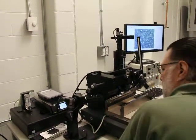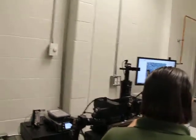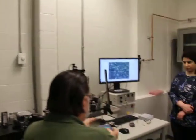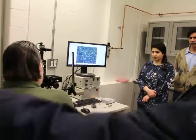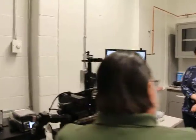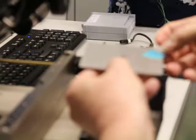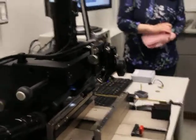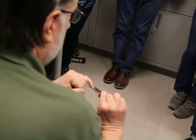So if you found that you weren't going to use a heater plate, and say that substrate that you had, that flex circuit, and you didn't need the heat from the bottom, what you could do is you could make up a plate that has vacuum channels that'll hold it down where you want, and you could just pipe in your own vacuum to that plate. And if you do make the plate, I'll give that back to you. You can use this calibration plate that's with the machine here, and this is what you'd want to do, is copy this edge here the way that it's made if you were making a plate that you would put into the machine.